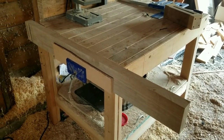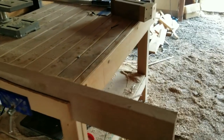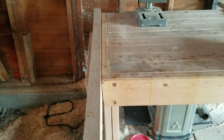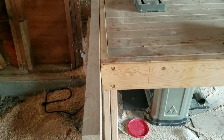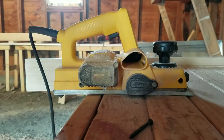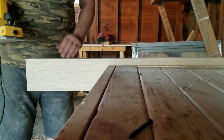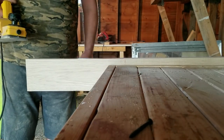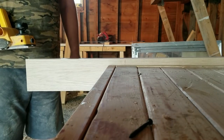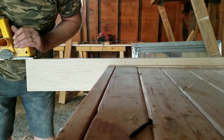What I've done here is put the first piece of board into my little vice down here with a scab board behind it, going directly up against the wood on my workbench. I'm going to use an electric plane and plane both sides down just a little bit to make them as flat as possible. This is my DeWalt electric planer and I've got it on the lowest setting. I don't want to take a lot off — just a 32nd or so off both sides to get it close to that five inches, so when I do the glue-up it'll be clean.